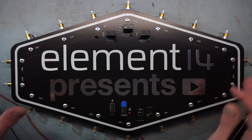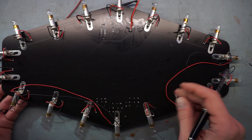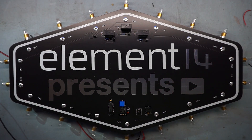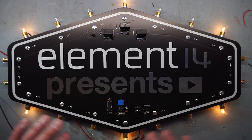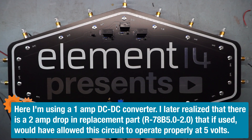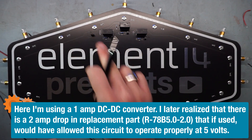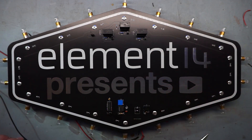Here we are — moment of truth. Everything's hooked up, the bulbs are all in, everything is soldered to the rear of the board. I did make a couple of mistakes with the wiring so I had to run some wires off to the side. Let's see if it works off of 12 volts. The bulbs seem like they're staying in their reset position — I think this is the first initial sequence for the CD4017. I can hear the relays clicking. I suspect this regulator is not able to supply enough current to the lamps and the ICs. Let me switch to the 12 volt side — but I don't want to run at 12 volts because it could burn out the lamps; these are only 6 volt lamps. I'll put the voltage higher than what the voltage regulator needs but lower than what would burn out the lamps, so maybe like 8 volts.